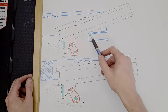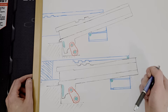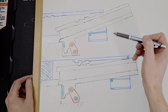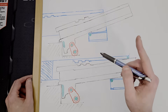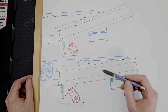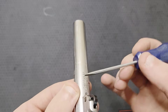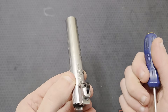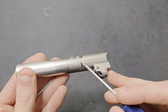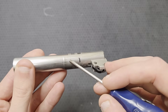The barrel will be at its most extreme upward angle when the slide is at its rearmost position. After the barrel is linked down, and regardless of the position of the slide, I think the only contact with the barrel should occur at the link pin, the lower lugs, and in the slide barrel passage at the spring tunnel and muzzle area. Here are the marks from the spring plug tunnel contact — they stop about here, which coincides with the measurement I took of the rearmost position of the slide. I don't think there should be any contact on the chamber area behind this point, or above this line, which is the highest point the spring plug tunnel contacts the barrel.